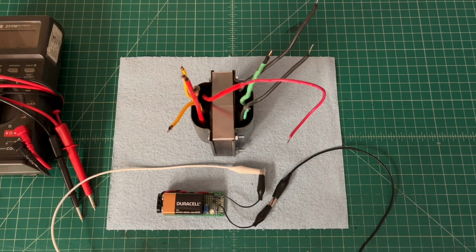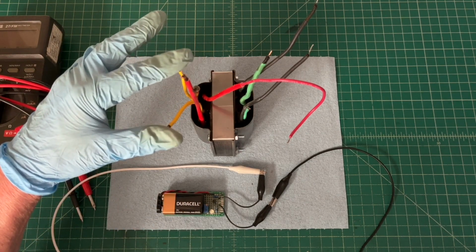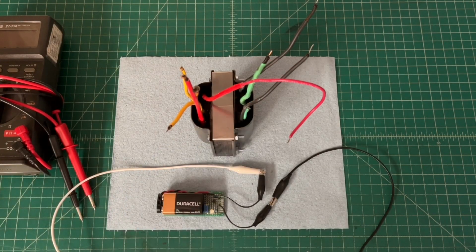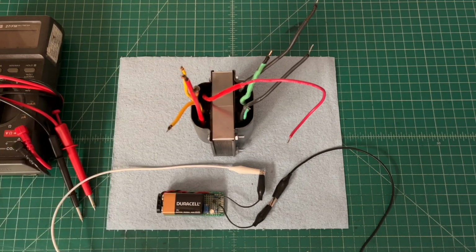Let me get my AC transformer over here and hook it up, and let's extrapolate the voltages for the high voltage in addition to both filament voltages, the 5-volt winding for the rectifier tube and the 6.3-volt winding, and just see what that looks like. Make sure nothing has changed on me since I did my preliminary test before taking this thing apart and cleaning it up really well.